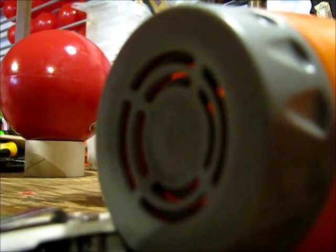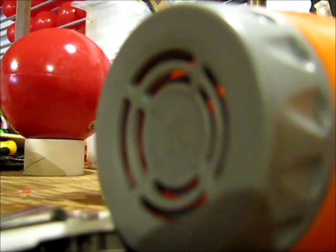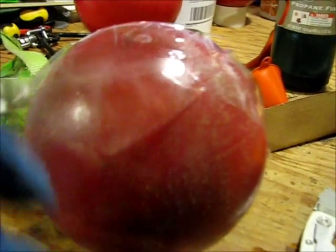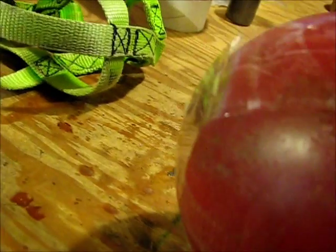What I'm doing is putting some packing tape over the top of the ball — two or three layers is usually good — and then I'm going to roll just a tape roll, an old cardboard roll or something, over the top of it. You're using that packing tape to distribute the force a little bit, and that'll take little crinkles and creases and stuff out of the plastic, little imperfections. Ideally you want to leave this tape on here for a long, long time until it cools down, because if it's too hot you can actually rip plastic off with the tape.